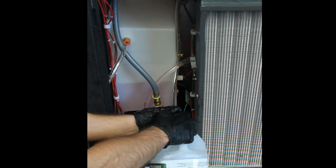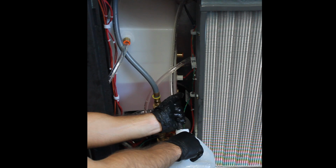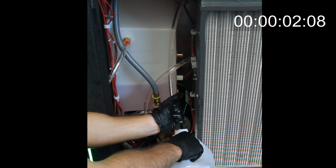You will be running the pump for about 30 seconds, and that should fill the container at least over 2 liters, typically more. Put the hose inside your container and power up the plasma. When the pump turns on, start a timer so that you know when 30 seconds has passed.